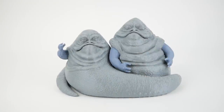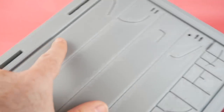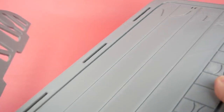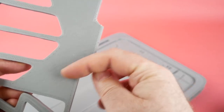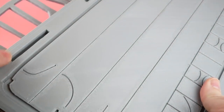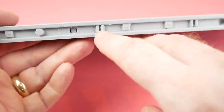It's time to move on to the rest of the model, namely their litter. These slots for the railing, just due to the nature of FDM 3D printing, are a little tight. What I'm going to try to do is cut these at an angle so they go into the slots more easily, and also heat up the slots with a heat gun to press them in more easily. One mistake I made when printing this is that I had it filled up with support material, which really wasn't necessary for the hole going all the way through for a pole to be inserted.